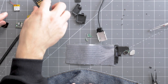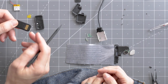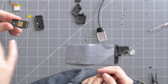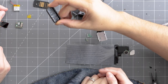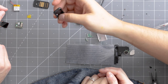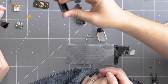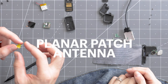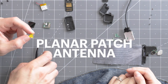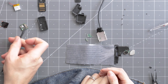Starting with the tag, it has this incredible outer layer with metal connections in-molded — you can tell they're in-molded because the plastic sort of weaves in between the metal. The opposite side is also a nice piece of molding with lots of local thinning and a rubber layer molded inside to create the button action and the seal. We thought this was a patch or planar patch style antenna design, and it connects like a monopole transmit line, with the ground connection mating with a little pogo pin.